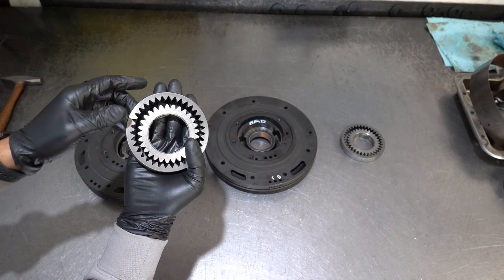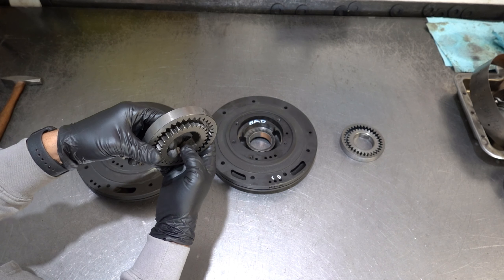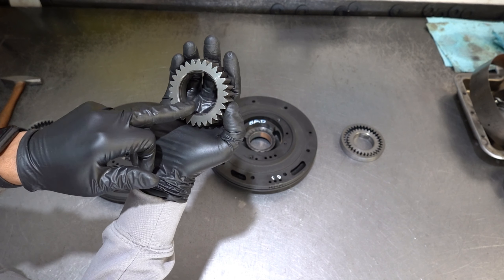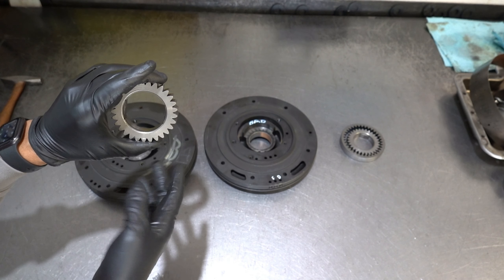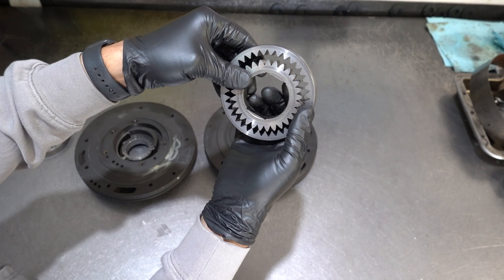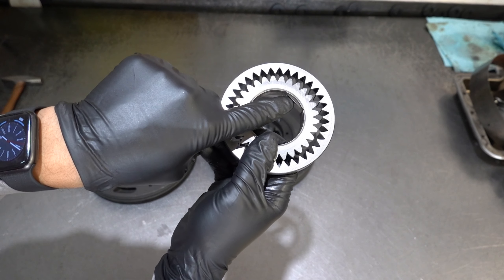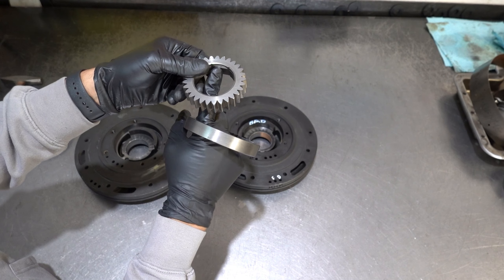For gears — these are the gears that came with the good pump. Are they in perfect shape? No, they have a little bit of wear, almost like witness marks, but it's visual wear, not physical. If you have a lip at the bevel where the torque converter flats engage on the drive gear, you can take a very fine rat-tail file and gently file it down — but this has to be minor in scope. If it's severe, just get a new set. The gears from the damaged pump have the same characteristic wear but also an indentation — a second lip — that I can feel. Something like that means don't reuse those gears.